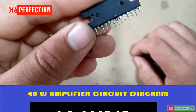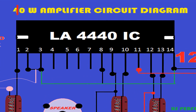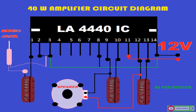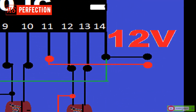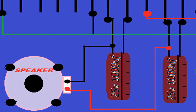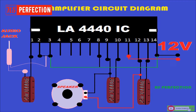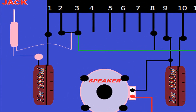This is a 14-pin IC. Pins 2, 3, 8 and 14 are the ground pins which are common. Pin 11 is for the power source. Pins 9 and 12 are for speaker output. Pin 1, connected by an electrolytic capacitor, is used for the audio jack.